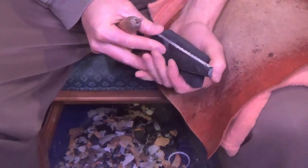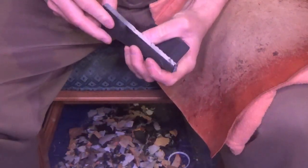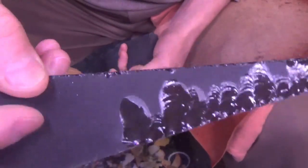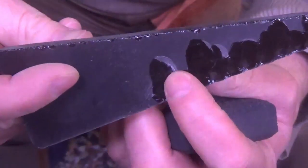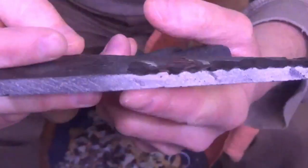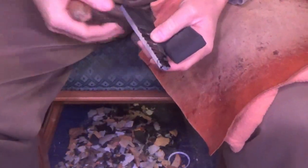See, look, I'm just taking just off the surface. You can hardly even tell. Now, I overemphasize that one, but you could hardly even tell that that last flake that I even took anything off. But see how far it runs? Yep. And that thing right there in the middle that you're seeing, that long flake, or the long island down here, not only can I get it from this other side, but I actually have enough of a platform on this side to take that again on a future pass if I want to. And that's really what it's about, is it's just skinning this little by little.